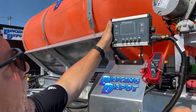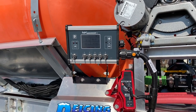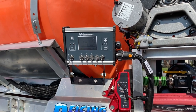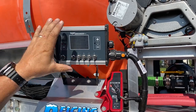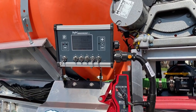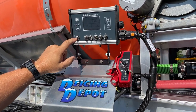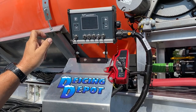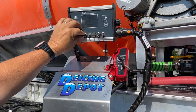So if we turn the unit on, you're going to press and hold the pro key. Let it clear. It's currently in auto. You can also change this to manual to bypass the GPS. Switch one is your left boom, switch two is your center boom, switch three is your right boom. There's still nothing spraying — this is your master switch. The master switch controls everything. If you flip that on, we just heard the valves open. Turn it off and the valves shut. You can leave the master switch on and turn those individual switches off, and as you turn them on they activate.